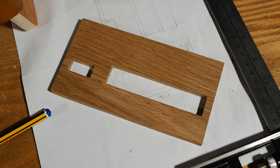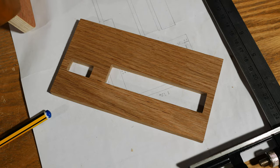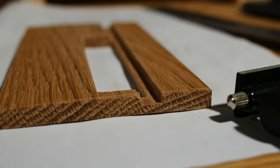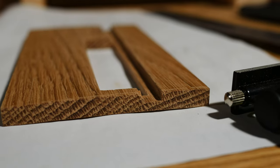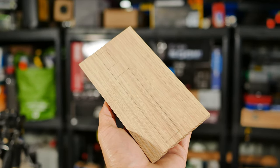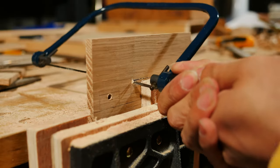Trouble started with a visible chip from sawing way too hard, where I tried to glue in a scrap of wood to fix it, but ultimately the whole piece itself was cupping or warping along its width. So we started again with much more manageable wood, taking extra care when doing both cutouts.